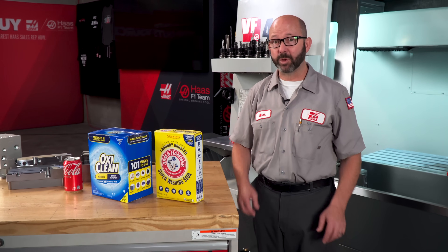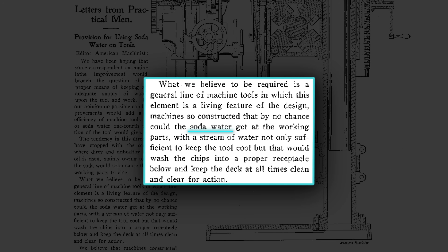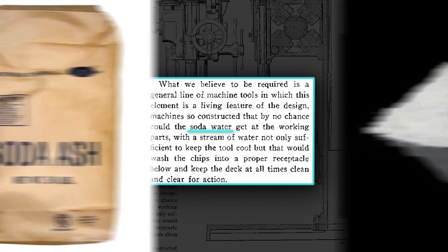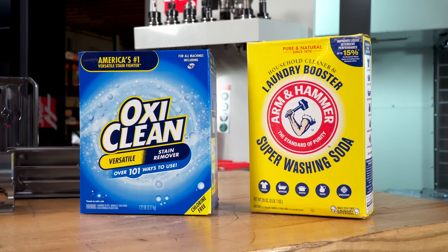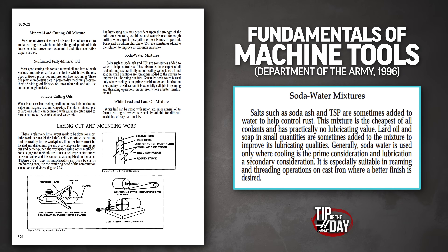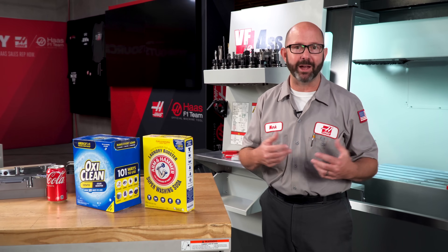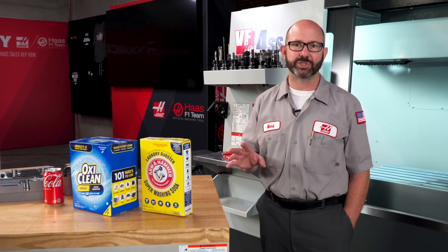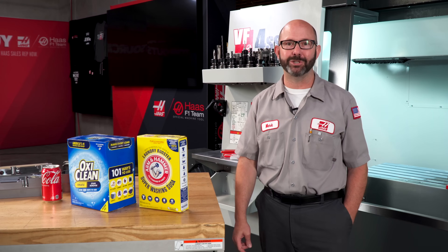As a closing afterthought, if you were reading along with us earlier in that American Machinist article, you saw that in 1899 they were using soda water as coolant. That was not soda soda, but soda ash, which would keep the water from rusting their machines. We would know soda ash today as washing soda, or sodium carbonate, the main ingredient in some stain removers. Machinists would use soda water to cool their tools, which in 1899 were made of high carbon steel that would wear out fast from overheating. They didn't even have high-speed steel yet in 1899, let alone the materials, carbides, and coatings that we use today. We mention all of this just to serve as a reminder that we are part of a long tradition of innovation and craftsmanship. Be proud of what you do, and we'll see you next time.